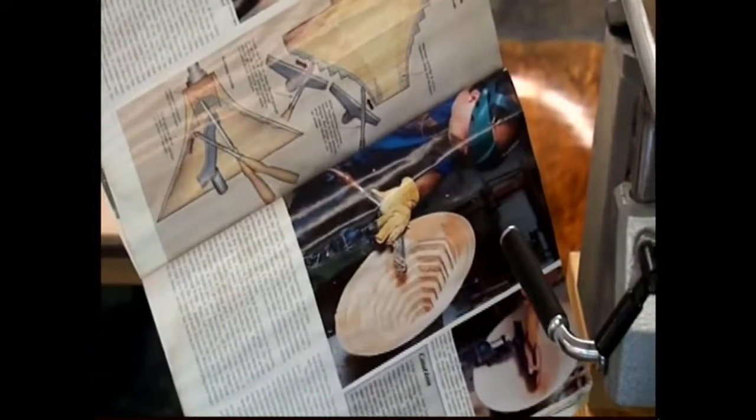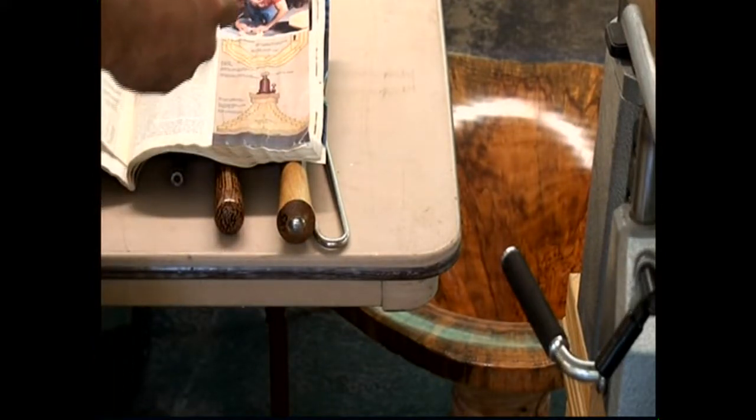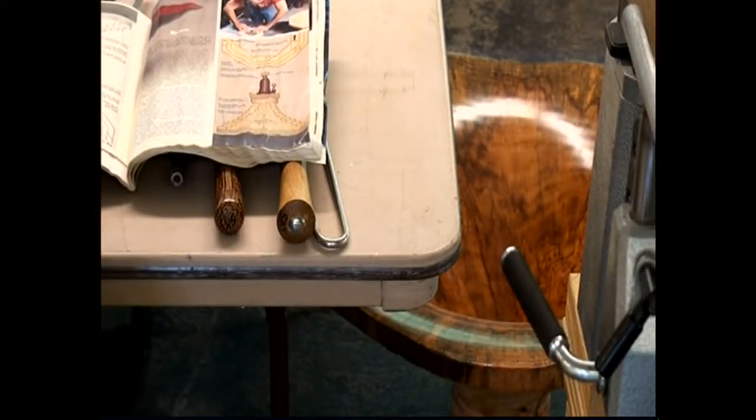So do you think that hot melt glue is what you really want to use on something like this? Well, that was just like an octagon ring. That was just to glue that. But when he stacked them up, he used Titebond glue, the yellow glue, when he stacked all the rings together. Yeah, when you glue end grain to end grain, or even end grain to side grain, it's not that strong. So hot melt glue just keeps it in shape. Then when you glue the stacks up, and the joints are offset, that makes it a solid piece of wood.